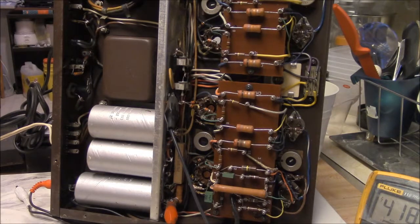It could be a little bit intense, and a lot of people don't want to throw a lot of cash at this stuff. I can appreciate that. The bad thing, though, is if you ignore some of this stuff, it can come back to bite you. Like if the bias screws up on the thing, the tubes could go out of control and eat up the output transformer. That would be bad. You can replace the tube, you can replace a component, but the output transformer, not so much. You could get it rewound somewhere, but it's a little bit annoying.